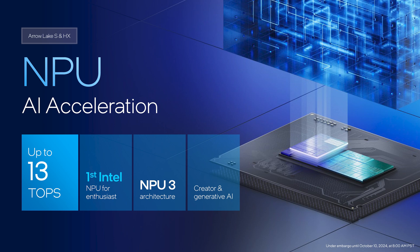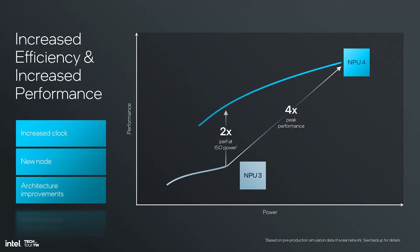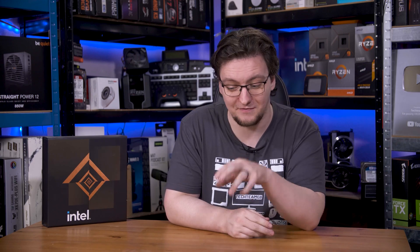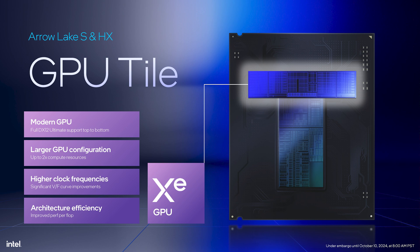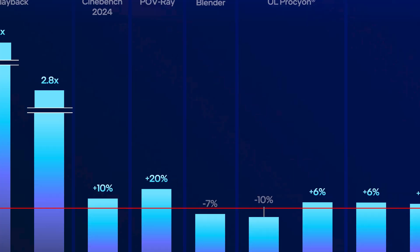The SoC tile has an NPU — a neural processing unit, aka an AI accelerator. It's worth noting this isn't the newest version of Intel's NPU found on the mobile-only Lunar Lake chips. This is the older NPU 3 from Meteor Lake, a 13-TOPS design, meaning it doesn't meet Microsoft's 40-TOPS requirement for Copilot Plus. Intel said in the Q&A after the press briefing that this was a deliberate choice based on available die space. They could have fit the newer NPU 4, which offers around 48 TOPS, but then they might have had to cut the integrated GPU — a quad-core part with a new design — along with the built-in media engine and Quick Sync for creators. So they opted for the older, considerably less powerful NPU 3 instead.